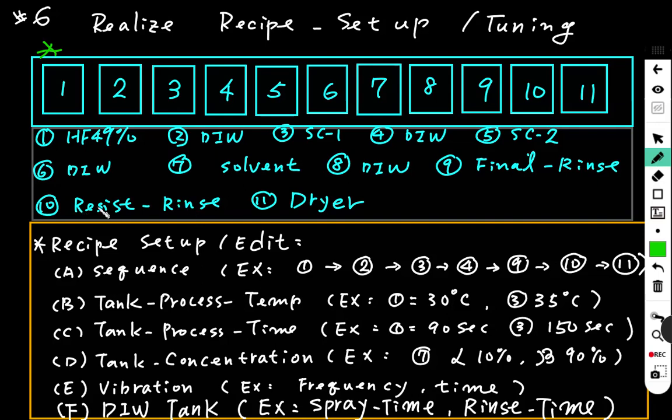Use the water resist value meter to detect its water resist value. If the wafer is still dirty with chemical residue, then the water will be polluted and the resist value will be small. Using this tank, we can see whether the wafer is clean or not, to make sure the wafer surface is clean.